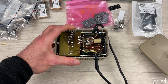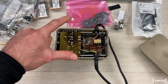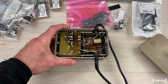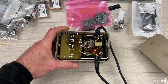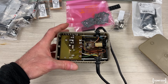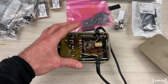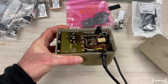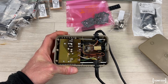What can happen is that the voltage regulator fails and it sends unregulated voltage to the chips. As a consequence your precious C64 is a write-off, because suddenly all the chips are dying more or less simultaneously. I've read some horror stories on the internet of people powering up the C64 — it would show a black screen — so they tried another C64 and then another one, to then realize the power supply had failed and it was just frying one C64 after the other.